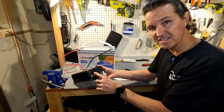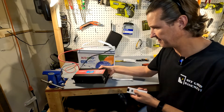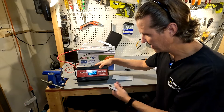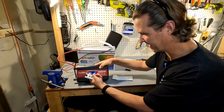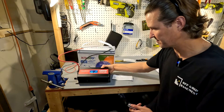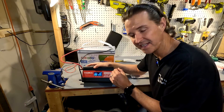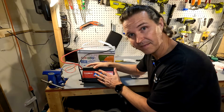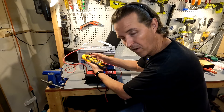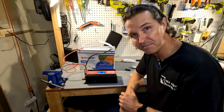The switch is right in the middle. I put it to off and it turned on — we have a display. Right off the bat I like the display because it is a color display, which I wasn't expecting. It has a battery capacity gauge, battery voltage, AC voltage, and the wattage being used. It does turn off as well. The documentation says this inverter is a little over 90% efficient and uses 1.3 amps standby consumption — around 14 watts — and I'm actually measuring 1.11 amps, so about 13 to 14 watts standby.